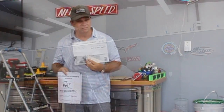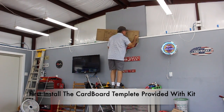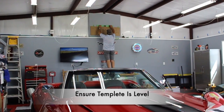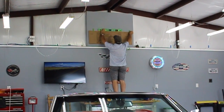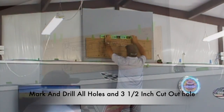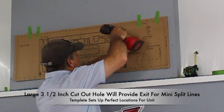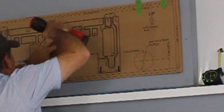Use a cardboard template to mark all the holes for the air handler. I of course use a level to make sure that it is perfectly aligned. Make sure you pay attention to the right and left side that the handler will set once installed. I went ahead and used my drill to mark the holes that'll be needed for the metal bracket. The first hole I marked is where I'll need to drill a three and a half inch hole with a hole saw — you can see that on the bottom right hand side of the template.